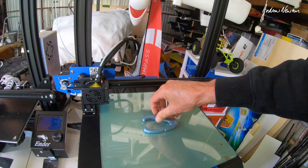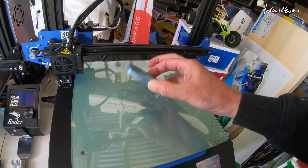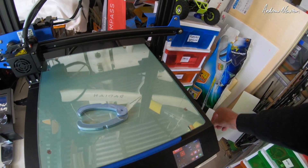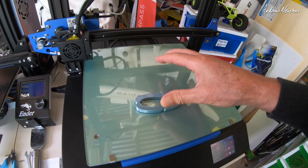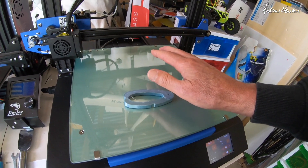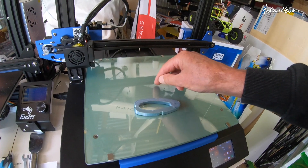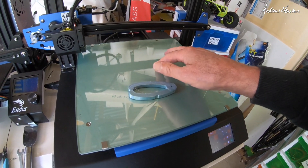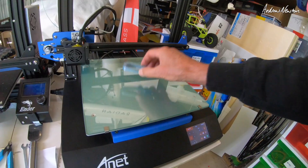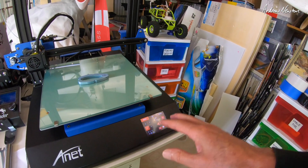This is a little gluing clamp that I've designed and made up, with a rubber band around there for gluing model planes together — it's working very nicely. There's a little skirt that's sticking. The problem I had was getting the Z home position, the Z zero position — the Z axis is sort of up and down — to consistently give me the right height above the bed so the first layer sticks nicely. From the first layer everything else builds up on top; the print quality is very good and it's working quite well.